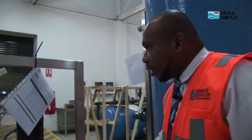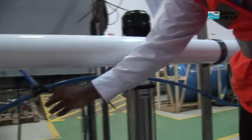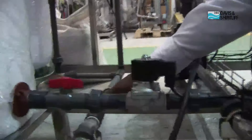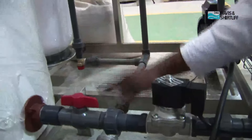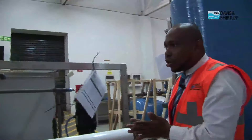As you can see here, the blue line is where you have the permeate water, which is also the treated water. Down here, where you have the gray line, this is where you have the wastewater. This wastewater goes to waste — to the French drain — however you want to use it. In some cases, we even recycle the wastewater if it doesn't have too high a mineral content.